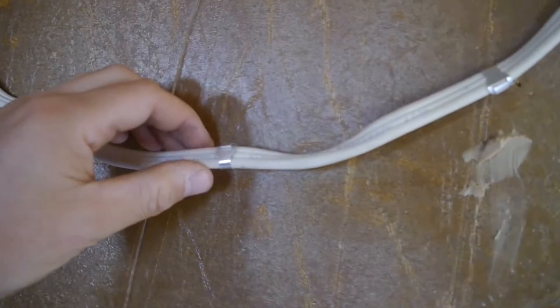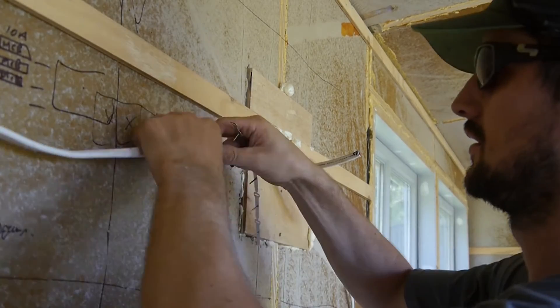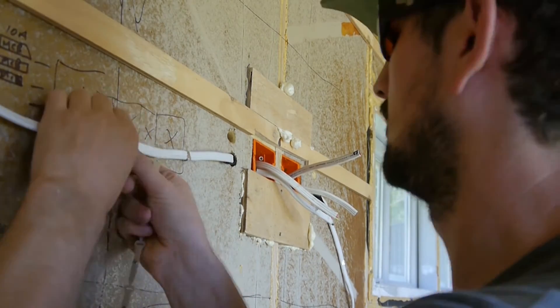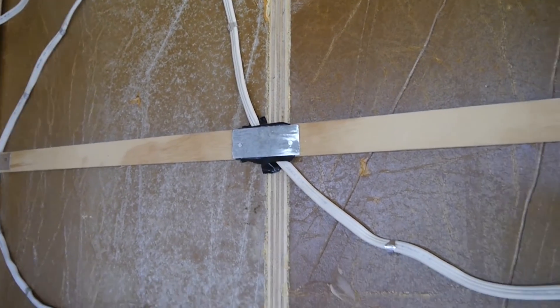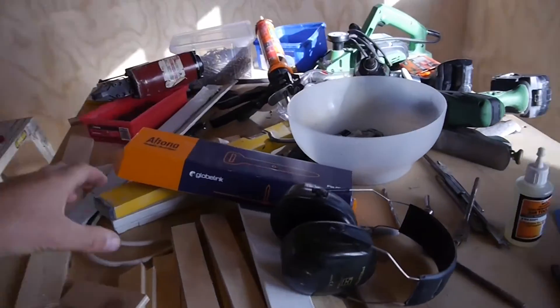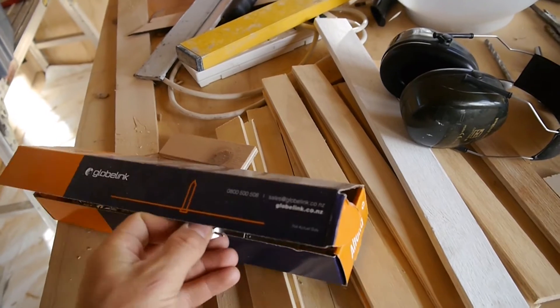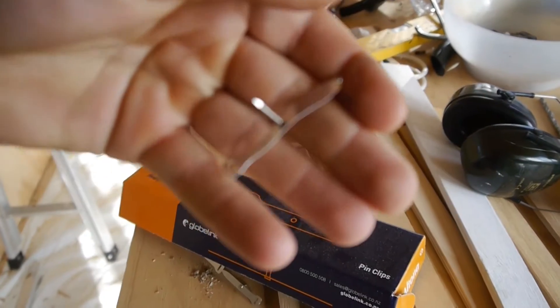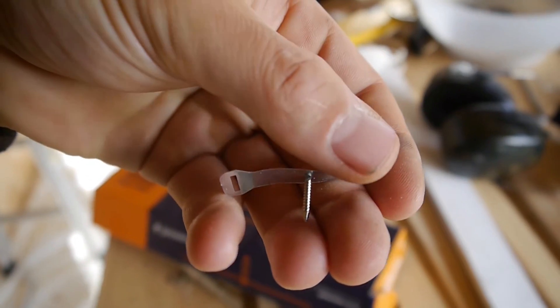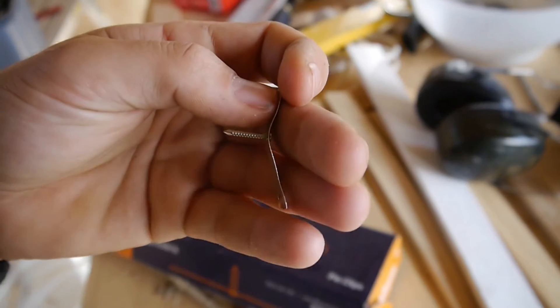These little pins work quite well - you just pop them in and they hold your wire. You don't want wires flopping around everywhere, especially when moving, as it creates noise and puts stress on the wire. These little clips come from Mitre 10 or anywhere, on a roll and quite inexpensive. You wrap them around the wire - if you're banging them into wood, bang them in first then wrap them around the wire.